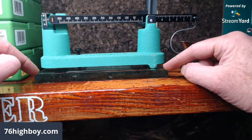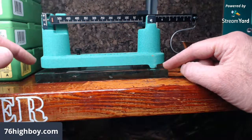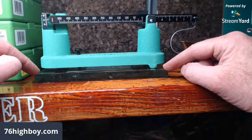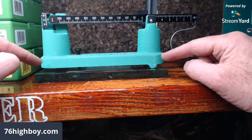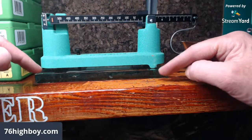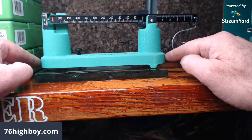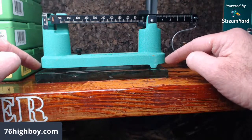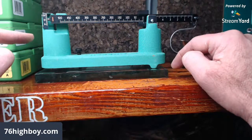This, because the way I'm always verifying it, I'll check it. A digital can momentarily drift and come back. Very difficult for a beam to do that, especially on glass. A beam type will drift and come back if you're on a rough spot, because you could nudge it one way and nudge it back the rest of the way.